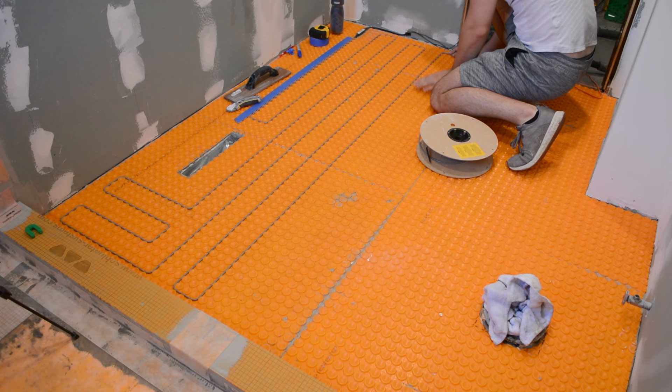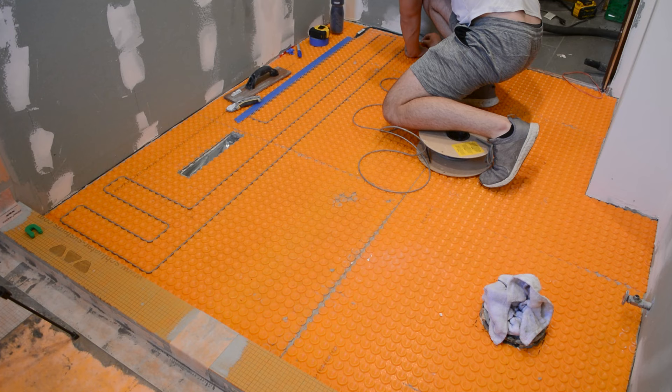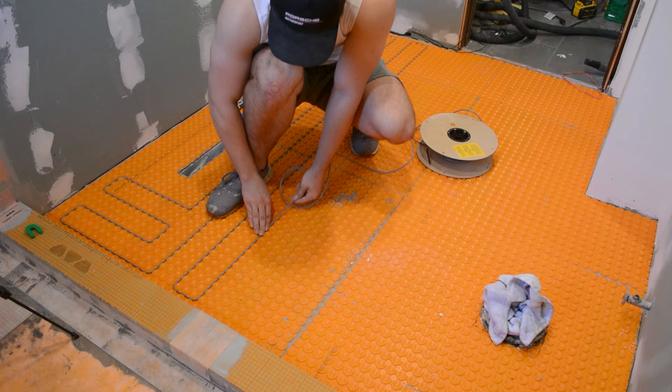At this point I realized I had made a mistake in my layout of the cable, but it was easy enough to just pull it back up — the mistake was only one row back, so it took about five minutes to pull up and reapply. With other heating cables these might already be glued or nailed down and it would be a lot more work to readjust. For reasons like that, I really like this heating cable as it's pretty DIY friendly.